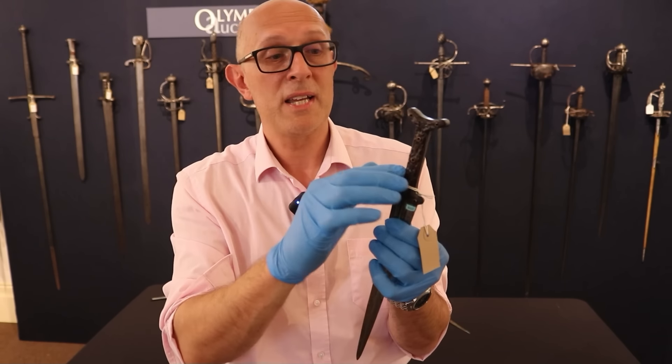With a wider grip, the guard and pommel essentially become part of the handle. An important thing to note about these discs is they are not solid metal — almost never, when they are thick like this. So when you see a rondel dagger in a museum or auction, if the discs are thick they are almost always hollow. They're made like a small box: a disc on the top and bottom with a strip going around. Sometimes they filled that drum shape with pitch, wood, horn, or similar material; sometimes they're completely hollow and brazed around the edge using molten brass or copper alloy.